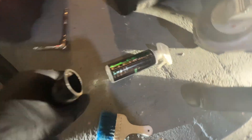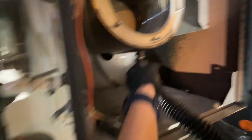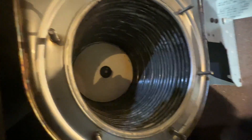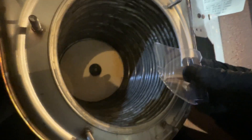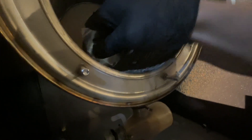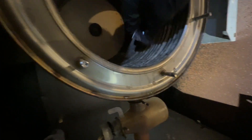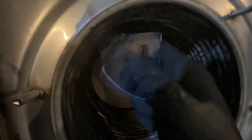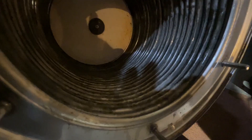I have my water — the bottle says glass cleaner, but it's just water. I'm going to hold the hose under here at the drain and rinse it off really well while it vacuums out the gunk and the nasty water. Per the request of Burnham Alpine themselves — every time I'm on the phone with them, they always give a reminder to clean in between the fins with a thin piece of plastic, like a credit card. So I just keep this thin piece of plastic in my Alpine box now to make sure there's a gap in them and that they're not plugged up with debris. That way everything drains out properly. I'll go through all of them and spray water again to make sure all that crap I dislodge gets rinsed out properly, because the tubes wrap all the way around.